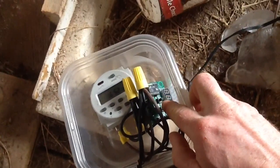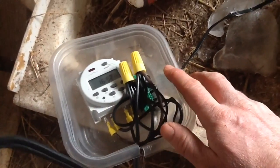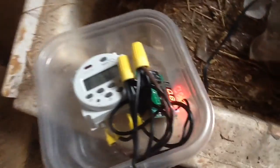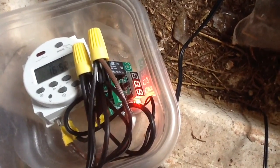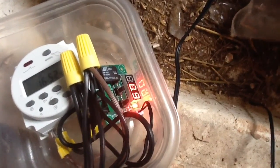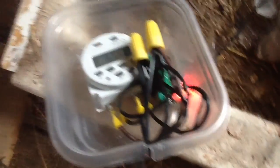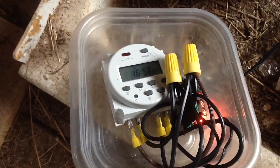This here is the thermostat. If the temperature is below minus five Celsius, this is going to switch on — and it is working right now, although I didn't set it properly. There it goes. So if it's below minus five, that will turn on and the red LED beside the numbers indicates the switch is open and transferring current. The DC timer, which I haven't set up for date and time yet, is manually switched off right now, otherwise there would be a red light there.